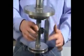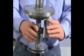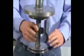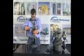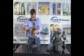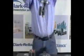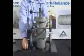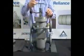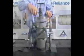Please consult your instruction manual or clarkreliance.com to find the correct number of turns required for your valve. At this point, it is a good idea to measure the distance from the control rod to both sides to make sure they are the same distance from the sleeve. Also, check the inside of the valve body for unusual wear or defects. Now, loosen the T-handle to retract the shoes and lower the stack back into the valve body. The bonnet set pin must be aligned to the corresponding hole on the body. The last step is to replace and tighten the cap screws and seal the shoes.